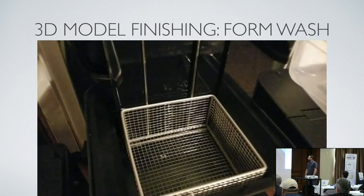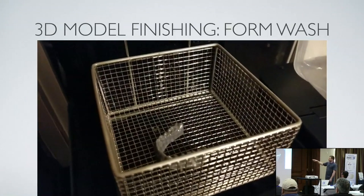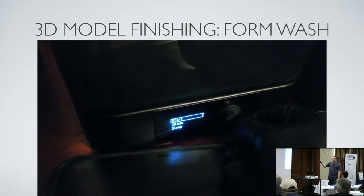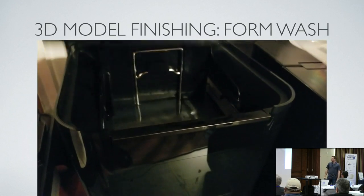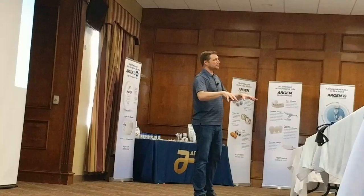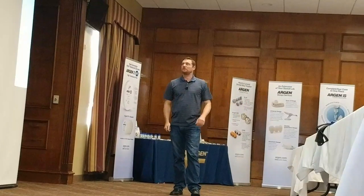So I decided to pull the trigger and got those three units. The Form Wash — love this thing. It holds about two and a half gallons of isopropyl alcohol at 90% or above. You put the model in this little basket after taking it off the build plate, drop it down into the alcohol, press start, and it has a magnetic blade at the bottom that spins up and reverses rotations every two minutes to wash the model. You don't have to touch it — it's another set-and-forget-it. It automatically raises up when done so it doesn't sit in the alcohol. Too many horror stories of ortholabs using the old dunk method and leaving it in there, ruining the model. 10 minutes.